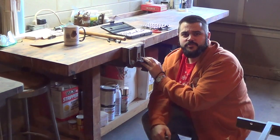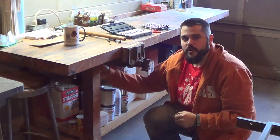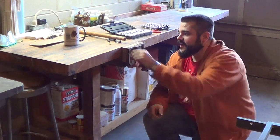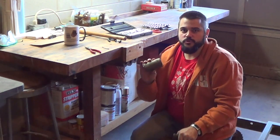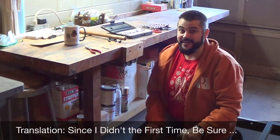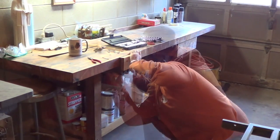To remove the vise that's currently on the bench, on the back of one of the long rails was a tiny cotter pin, or a large cotter pin, that I had to take off. Be sure to support the slip mechanism while you're pulling it out so it doesn't fall to the floor and get damaged. Hammer time!